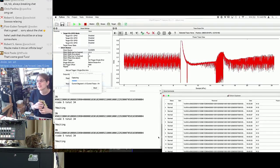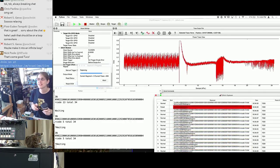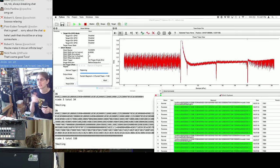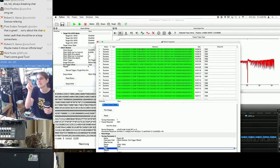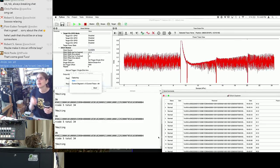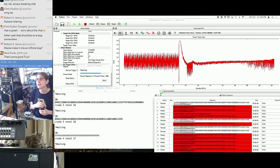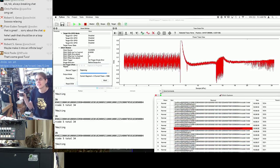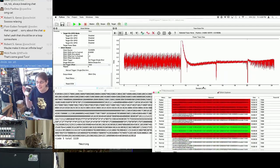Oh yeah. So, I know you can watch the full Face Whisperer video if you want to see the full story behind this, but I did have a slide that had basically the money shot here. The top right trace is the power trace coming from the ChipWhisperer. You can see it has this waveform that's lined up, and that's because of the attention to detail with timing, so everything's in lockstep.